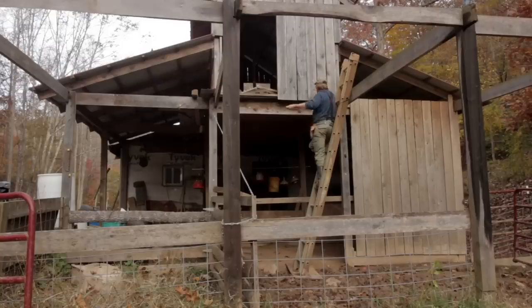So I'm just measuring off my length here. We know we were less than eight feet, but we're just going to confirm for our actual nailing length. We are 89 inches. We'll start there, and knowing the guy that built this barn, we'll take a measurement every couple feet because I guarantee you it's not 89 inches at the end.